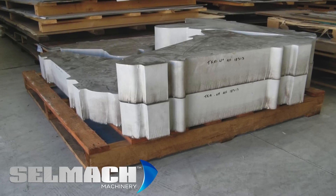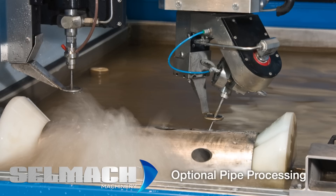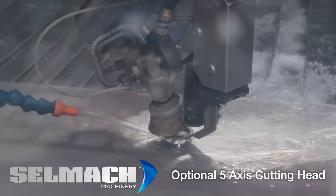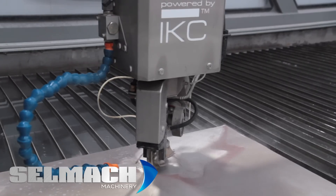One of the common questions asked is: what thickness will the waterjet cut? The answer is you can cut whatever thickness you can fit between the machine head and cutting base, but as you increase in motor size the cutting process will be quicker. Therefore, once you know your incoming power supply, you can select the right pump for the cutting time that your production requires.